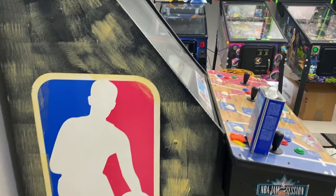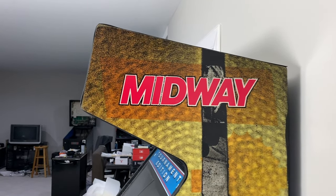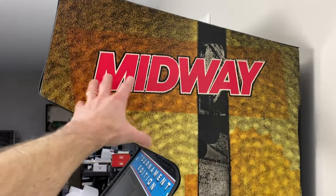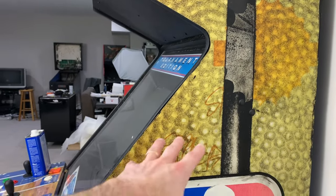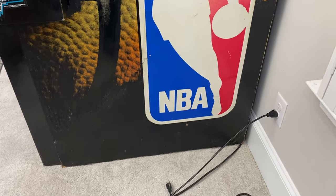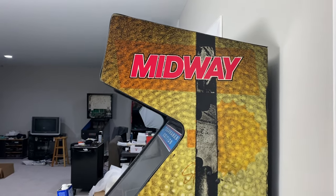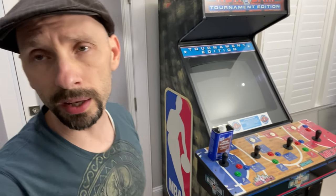I'm going to leave this for 45 minutes and see what happens. Now, this is the other side which I've already done with a couple of passes — three or four passes of Citrus Strip followed by wiping down with naphtha. You can definitely see there was some kind of stickers here, and somebody wrote something on there. I do have a couple more passes to do on the bottom to clean up, but I think that looks way better than just flat black. They even used a textured paint — kind of gritty and nasty.